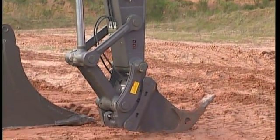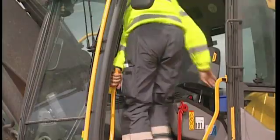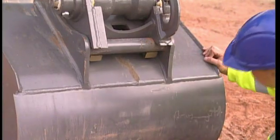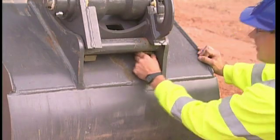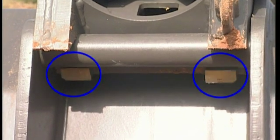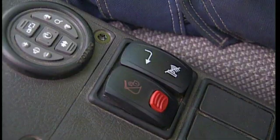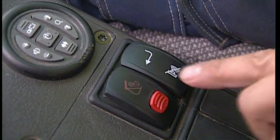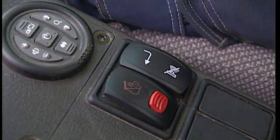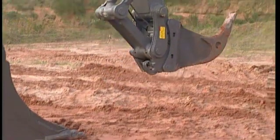Make a backhand test on the ground to ensure that the attachment is secure. To be absolutely sure about the locking procedure, leave the cab and visually check that the wedge is under the front pin. Delete and confirm the alarm on the display using the switch on the left-hand side of the QuickFit switch. Now the excavator knows the attachment is hooked on and you can continue with your work.